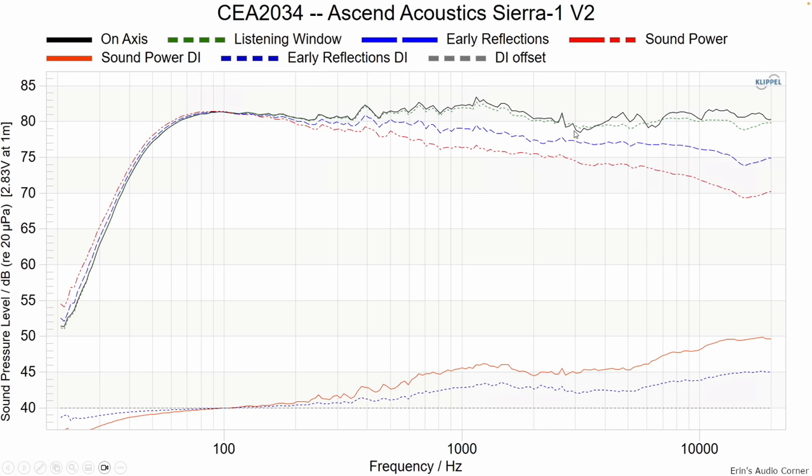Keep in mind that 96 decibels at 1 meter is just with one speaker — two speakers in a room at that output level, backed up to 3 meters, is going to be about 93 decibels. So that's pretty dang loud. In terms of compression, this is where we see some issues — there's some incapability for this speaker to get extremely loud. I don't necessarily expect that for modern listening distances at reasonable volumes you're going to have any sort of issues. I didn't have issues — no mechanical noises, no plopping of any woofers, no port chuffing. But this helps give you a better idea of what kind of dynamic range your speakers have if you're building a home theater.